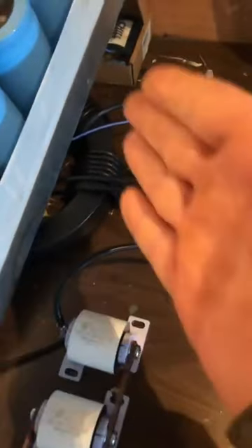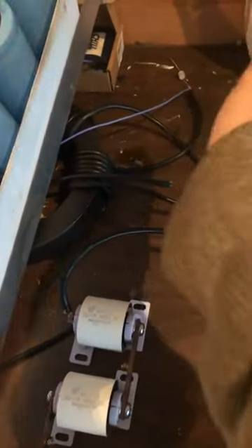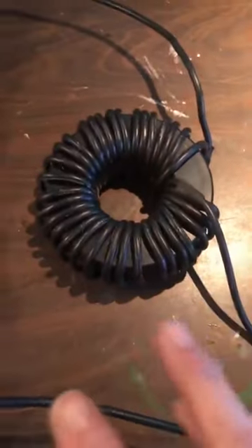These other 30 kV diodes are used in this transformer. They're used to rectify the output after we've raised the voltage. We shouldn't get a kickback back that far, but if we do, on the positive side we could place another one of these diodes in line as a protection diode in the same forward facing direction, so that if a kickback did come back, it would stop it. Because if it gets back into that core, literally everything on the driving end could be susceptible. So those are the most critical diodes.